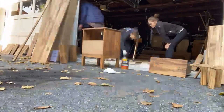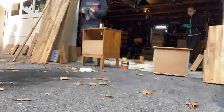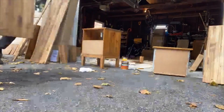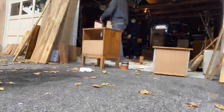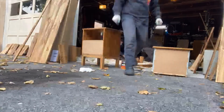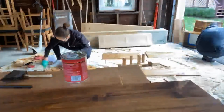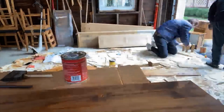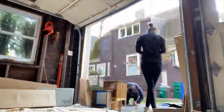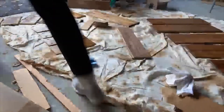After we drilled the holes, we put one more coat of stain on a few pieces, and then we started to go in with the poly. Our neighbor does a lot of professional woodworking, so he was kind enough to come over and help us out with this part. The polyurethane, when you first put it on, has a lot of bubbles and can be quite sticky. So what you have to do is put one coat, make sure it's really smooth with no drips, and then let it dry for about six to seven hours or overnight, and then sand it before going in with a second or even third coat.